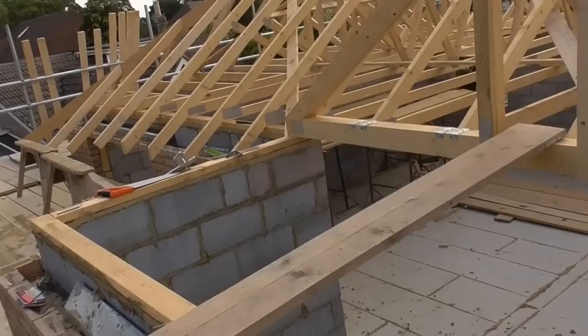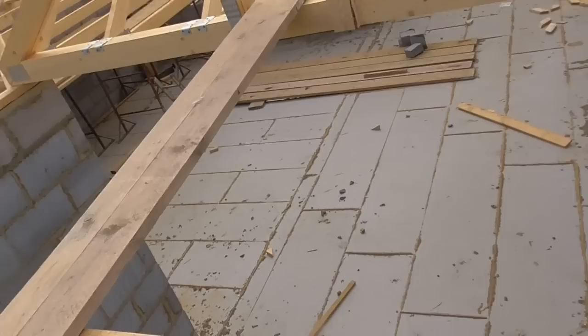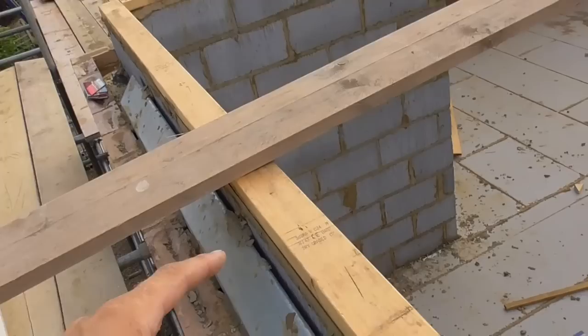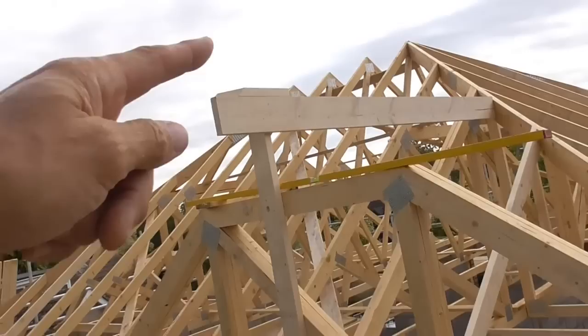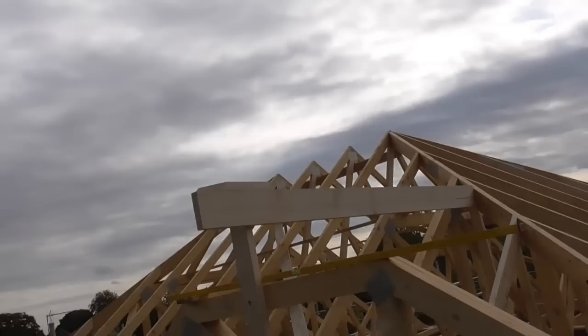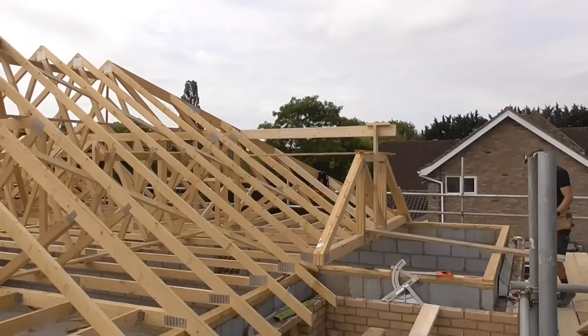Using this measurement, obviously we can just apply that to a rafter table, and I can get myself an end common rafter which I can basically just hook on. I'm going to probably put a bit of extra 35mm material on top of here, because as I said earlier, there's no bird's mouth in this timber, and it's going to really help to have a bird's mouth. Once I've cut that rafter, I can just lean that up. Where it hits that ridge board will be the point where I can put my two commons, well, there will be jack rafters, but I can put my two commons up, nail those, and cut that off, put this end one in, and then we're rolling, and we've got our points to fit our hips to.